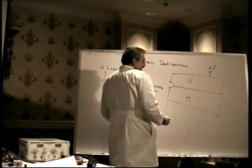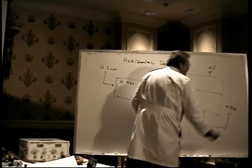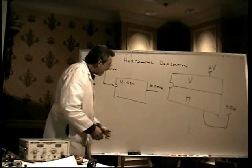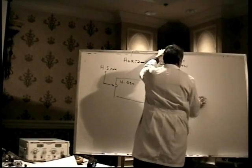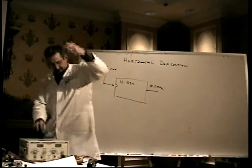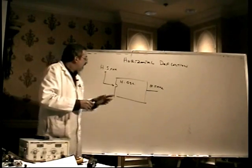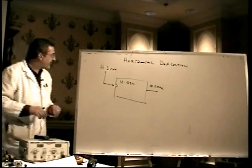There's a 12 volts that goes for the vertical, and there's another input that's plus 12 volts for the horizontal. Two completely separate power supply inputs. But it's one chip, and again, it's real reliable. The only time I've seen this fail is when I've caused it to fail or someone else has caused it to fail due to carelessness. So it's really the same. It's the TDA 9102 that I showed you before. I'm not going to show it to you again.